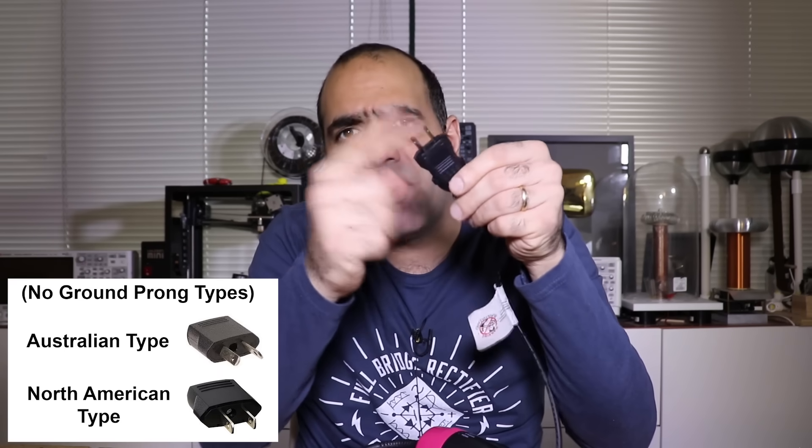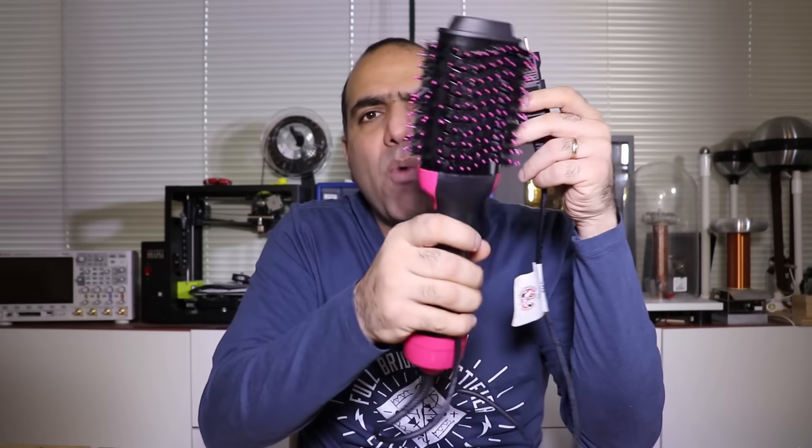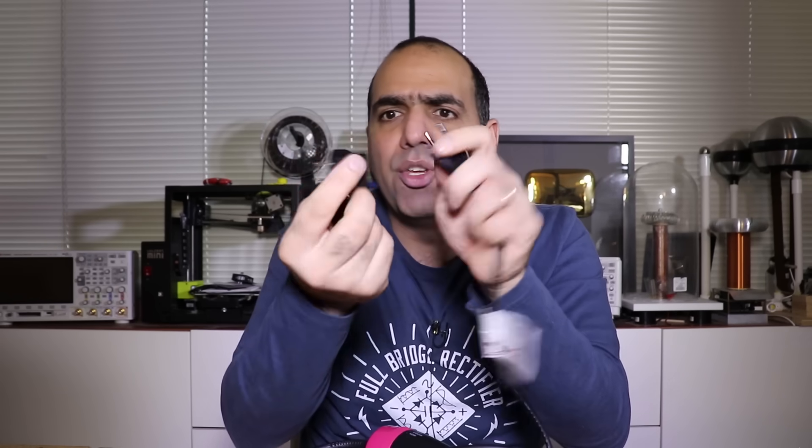My sister-in-law ended up in Australia and now she needs 230 volts to run her hairdryer. What she needs is a power adapter, and she bought this. But it only converts the Australian plug shape into a North American plug shape — and in fact this thing was purchased from China so it already had an Australian adapter on top of it. You could directly connect it; it doesn't matter. All we need is something to convert 120 volt AC to 240 volts.